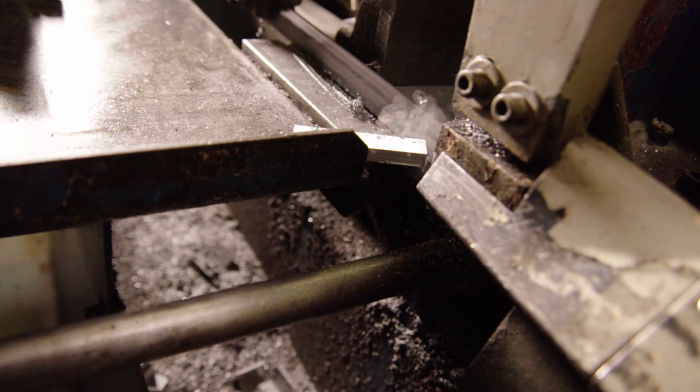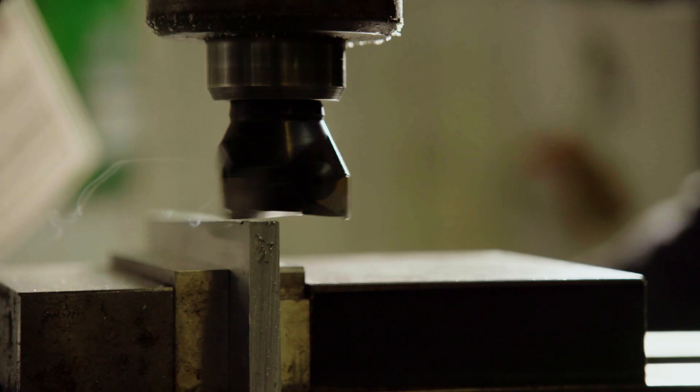We really didn't know if we could do it — we weren't sure. It's really exciting to have a problem like this; it's so big that you're not sure if you can solve it or not. We're at the mechanical limits of the pins that hold our rig onto the knuckle couplers, so we had to get chrome moly steel pins and have them heat treated so they would stand the forces being put on them. The only way we can really address that is we've got the engineering calculations, we've got the adhesive technology, we've got the know-how.